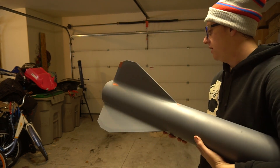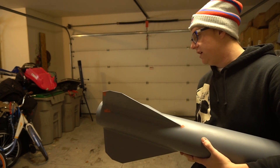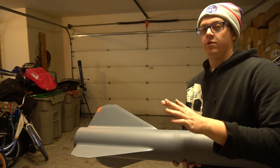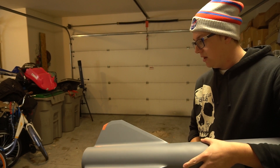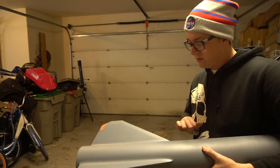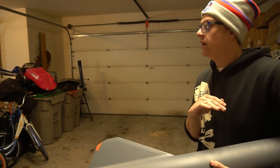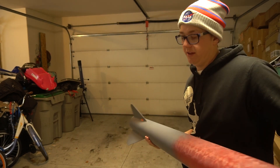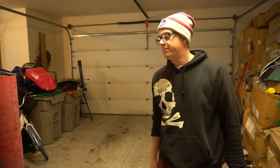I filled those and sanded them out - there's actually another one right there but I didn't notice it, so whatever. Again, little things that you're not going to notice especially with the color I chose. Let's go throw this on the old sanding table, smooth these out, and hit the whole thing with probably 800 grit wet sandpaper. We'll knock it down dry with like some 400 and then finish it off with wet sanding. Then we'll hit one more coat of primer - probably white primer - and then lay down our first coat of color. It's worth noting it's about 42 degrees outside, which is not ideal painting weather, but I'm not an ideal painter, so let's get to it.